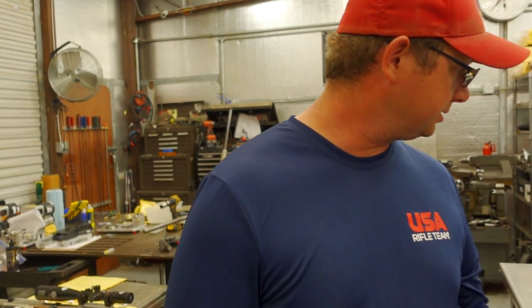Yep. So, if you're not cutting deep into the shoulder, you can just use a 40-degree cutter and cut everything. If you're going to cut pretty deep in the shoulder, we make different angles all the way down to 20 for the 308 guys and all the way up to 40. But the case holders change out pretty simply. I can show you here.